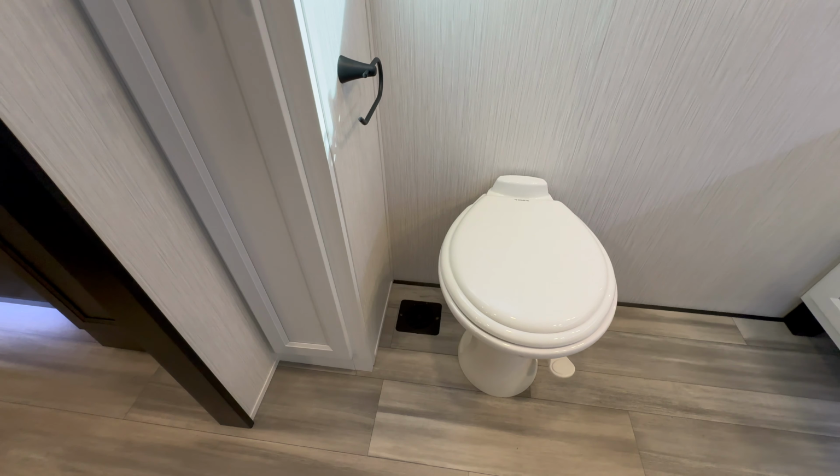Plumbing an RV toilet directly into the sewer is nothing new. Many stationary RVs choose to do this as well by taking out the black tank and plumbing it directly into the sewer. The cool concept about the RV Residential Flush valve is that it still retains the option and the capability to utilize the black tank when you're not hooked directly to the sewer inlet.